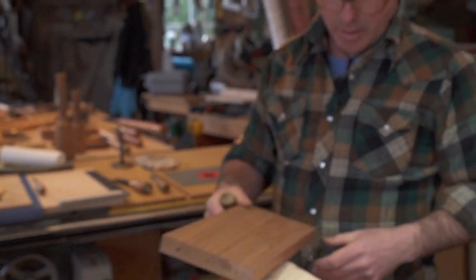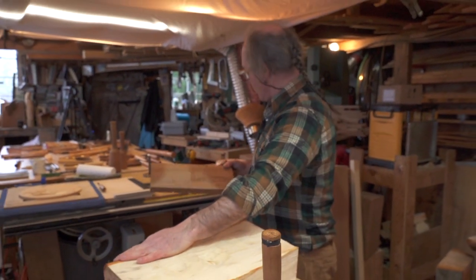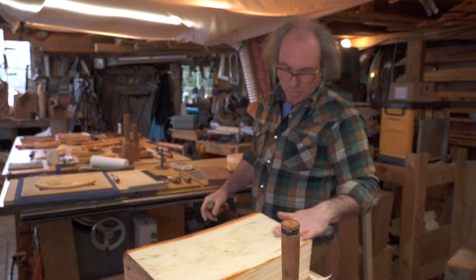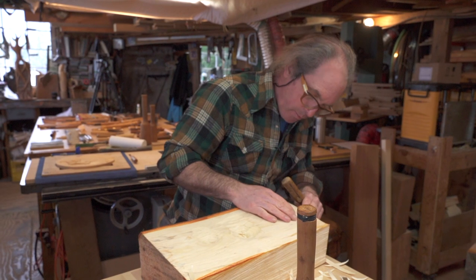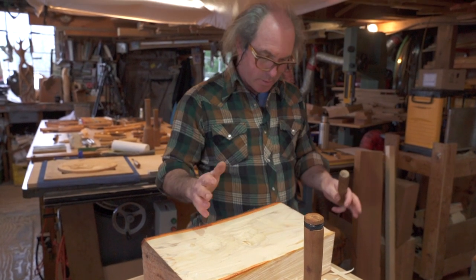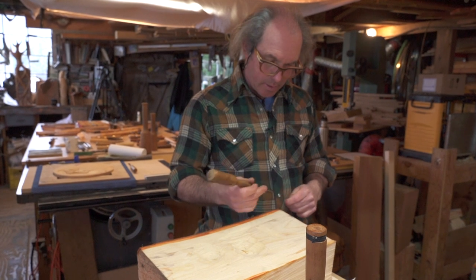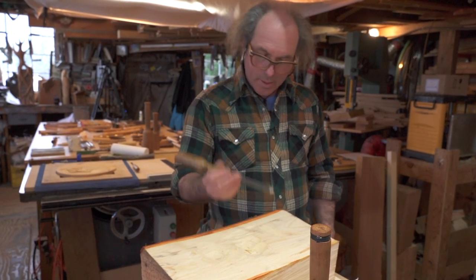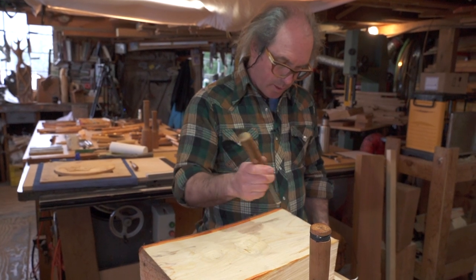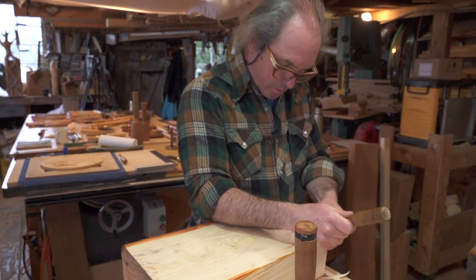There's some techniques to texture the work, so your finished product doesn't always have to be sanded or planed perfect. Sometimes you want to texture the surface. And there's different techniques for texturing, larger scale and smaller scale. One of the techniques, and this is a good gouge for it, is across the grain and just making little cutouts